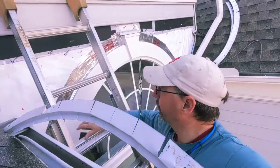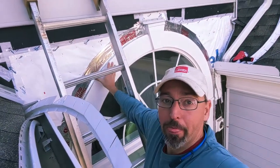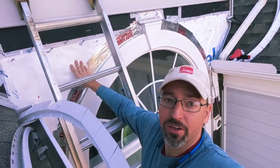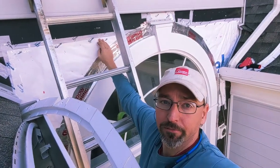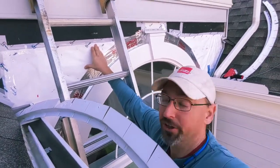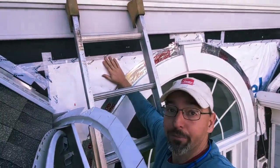The way the house wrap was set up, there was nothing that really prevented water intrusion. There's just tar paper on here, running right behind the trim product, and there was nothing keeping the water out. They did have some flashing on there but it wasn't secured, wasn't adhered, and the layers weren't lapped right. So our guys knifed through the tar paper — I talked about that in another video — and then tucked the Tyvek house wrap up behind this, brought it out, and taped that seam.